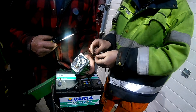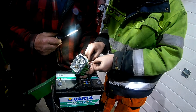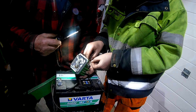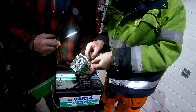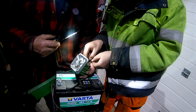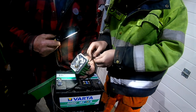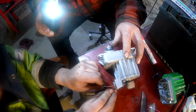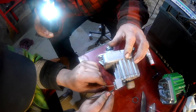We took the old stepper and did some testing on it to figure out how you could give it a few pulses and see the sprocket actually move, and to verify that the new one had good resistance and that the coils inside seem to be where they should be. So we had the other one out, but there is kind of an indentation and a spring that holds it in the center position.